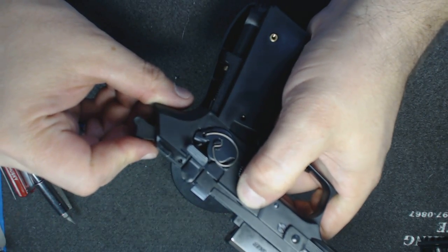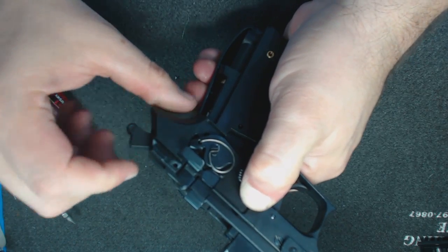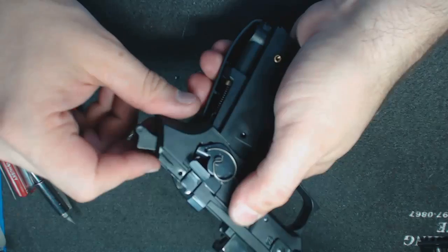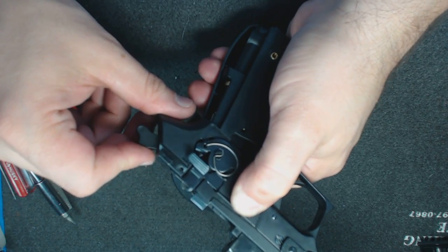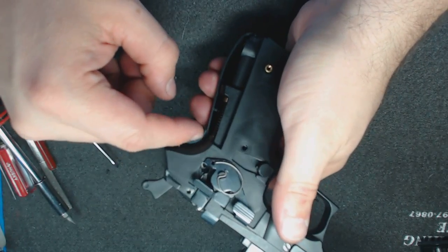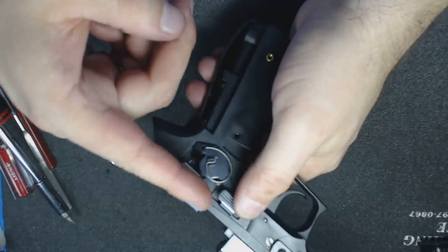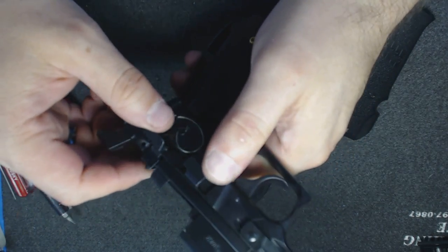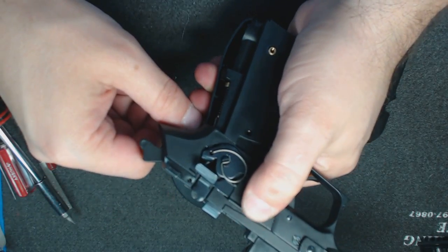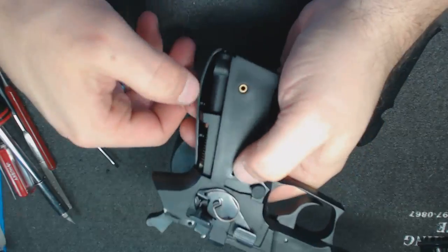When I bring the hammer drop up, you can tell that what I'm doing is it's just hitting the bottom of the sear and pushing the sear out of the way, but it's long enough that it gets caught by the hammer as well. So the way Sig likes to make these hammer drops is you're not under a whole lot of pressure till you meet the sear, but once you push the sear out of the way, you're catching the hammer on your thumb as well, and that also just helps it guide down, and essentially guarantees that the sear will be ready to catch it in the half cock notch, because your thumb has got to ride it back, and it's going to prevent it from just dropping the hammer. So basically the hammer drop is right: you intercept the sear and the hammer, and so now you're no longer intercepting the sear and you're letting the hammer fall, so it lands in the half cock.